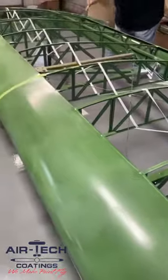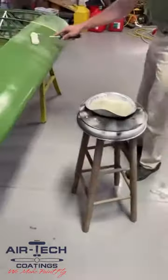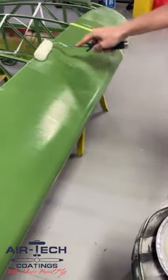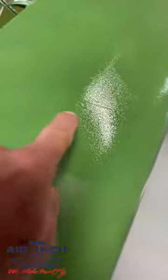Basically, just starting off, we're getting the base of the glue down. One fast way on the leading edge, what James is doing: take a little 3-inch or 4-inch roller, get your thick mix, and you see once it gets the layer on, then go back and you don't want any lines left, like the little lines here. Once he's done, he'll take those out.